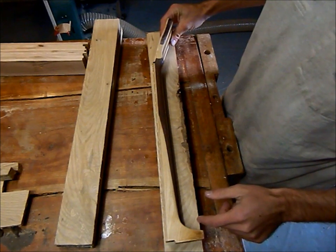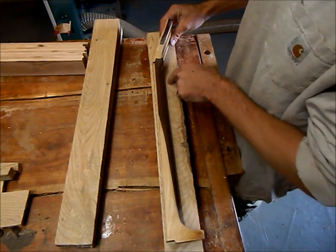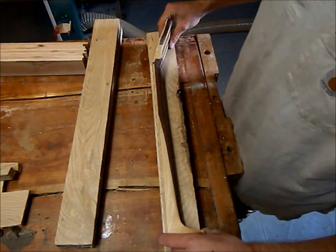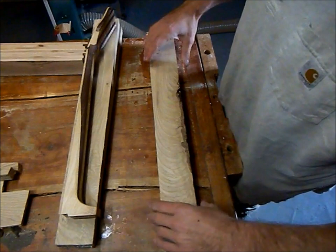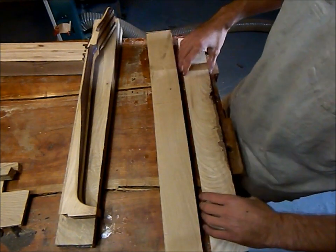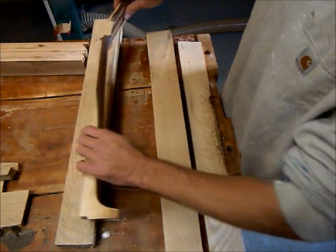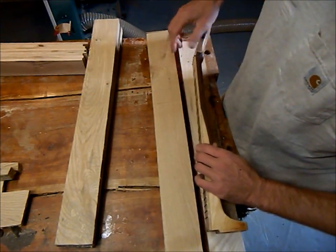But what I'd like to display in this neck is this grain right here. These are 1/4-inch strips. So I lay my neck down when I'm doing this, and I'm striping it with pretty straight grain cherry in between each one of these pieces that are really gnarly. So that's straight grain cherry, but then with the fillet, where the head's coming in right there, that's going to be figured.